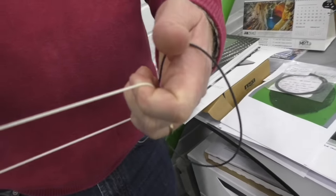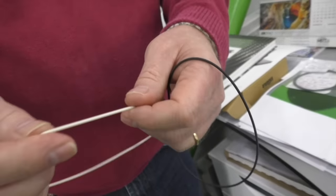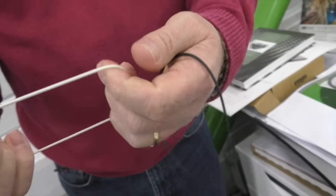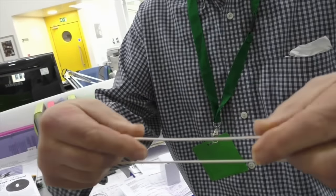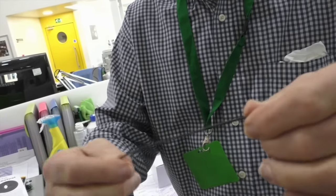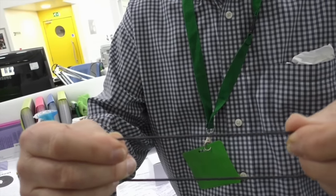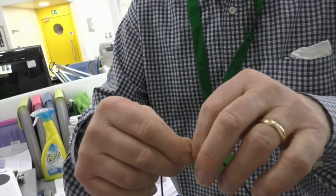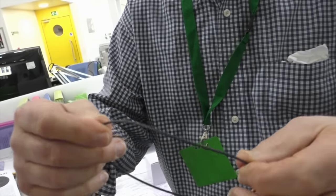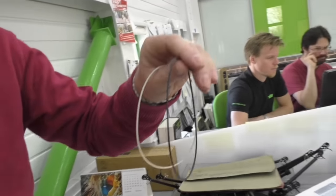One important characteristic of the material is its hysteresis — its modulus — how it behaves, how it stretches, how it recovers, its hardness, and how consistent that hardness is in the belt. If you gently feel this drive belt, you'll feel a characteristic there. This is a new prototype we're working on — you feel a difference — you can almost feel a squishiness as you move it where your fingertips are. These are actually two different types of rubber together: one's an EPDM, one's a polychloroprene.